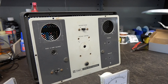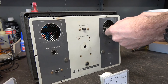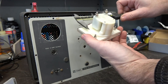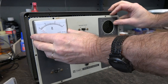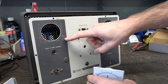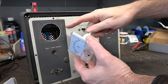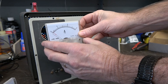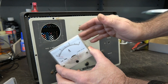Here's where the work comes in — you have to modify the panel for your new meters. If you have a set of meters with a pilot hole of around 52 millimeters you can drop them right in, but these require about a 60-millimeter opening, which is not going to work. So I'm going to put this on my milling machine and open it up to a 60-millimeter square, because I can't cut a round hole too well on my mill. After that I have to drill the holes for the mounting lugs — they'll look super on this thing when it's done.